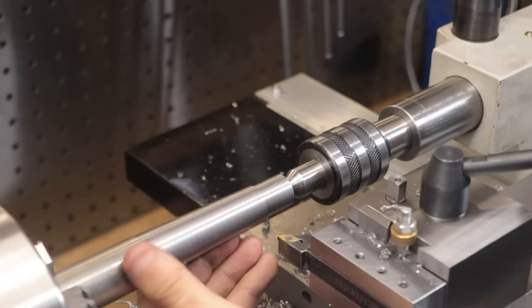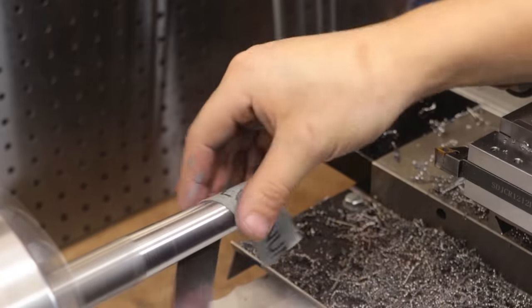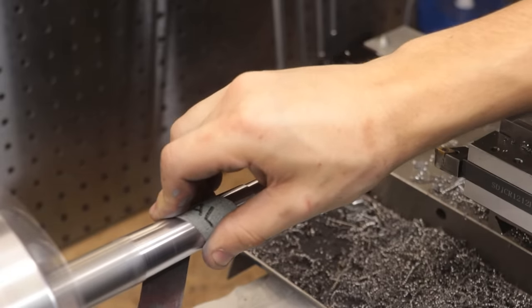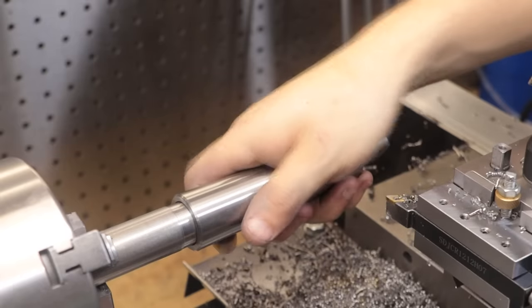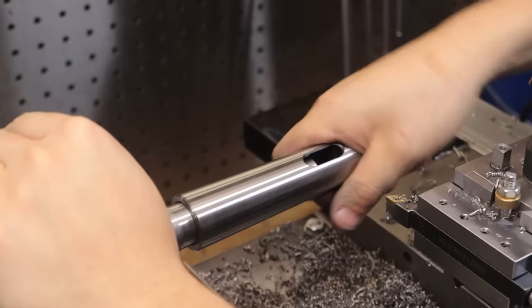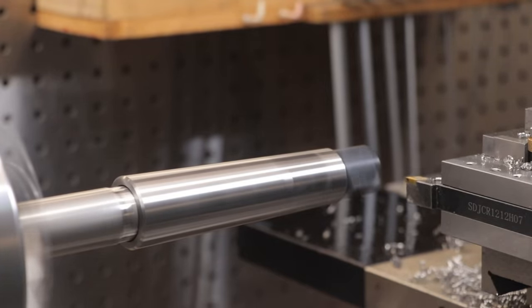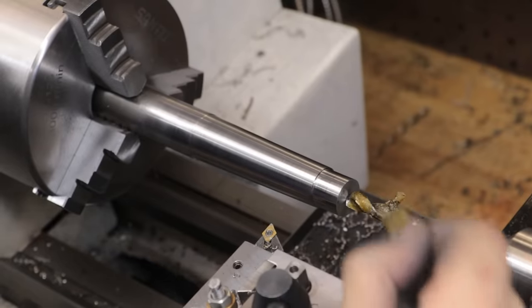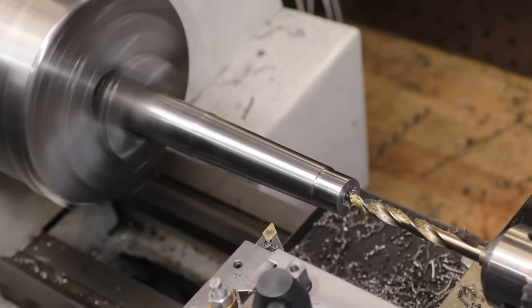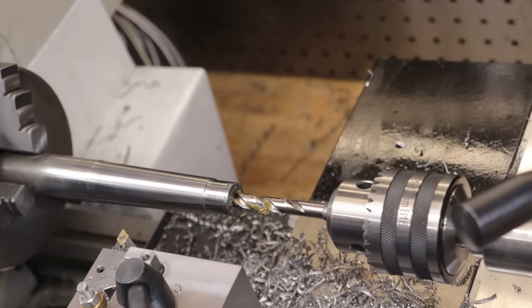The carbide insert left an okay finish, but I'll clean it up with some abrasive paper. I can now test the fit on a Morse taper sleeve to see how well I machined the taper — the two tapers are locking up really well with only minimal pressure. I don't have any bluing compound to see the actual contact patch, but given that I can barely see any runout on the part, this should be good enough for a tap follower. While everything is still in its original setup, I'll come in from the back and drill a single through hole, using an almost brand-new split-point drill to avoid the drill wandering off center, then follow it with an extended drill bit.